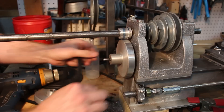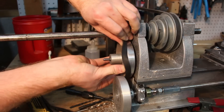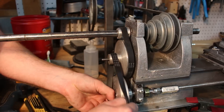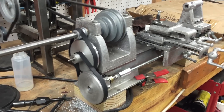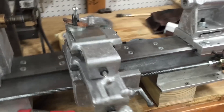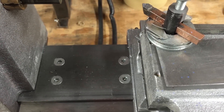I used flat vacuum cleaner belts versus the round cross-section belts described in the book — it's just what's available. I added the belts and it all seems to work just fine. The only thing is I really need to add crowns on those intermediate and lowest stage pulleys. I've actually already used the automatic feed to bore the tailstock, and it works pretty well.